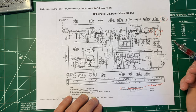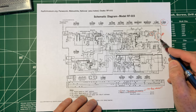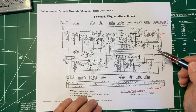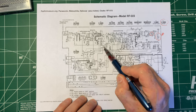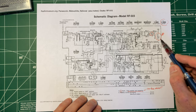I'm assuming it's a capacitor because some signal is getting through but it's not tuning. It could be a broken tuning condenser. I suppose that's the band switch and the tuning condenser — there's the FM/AM switch. I still think that seems like a good target.